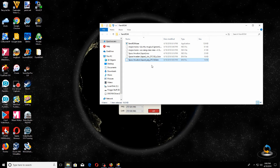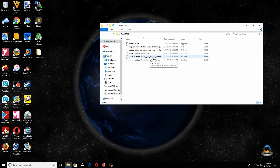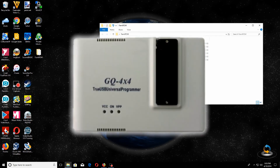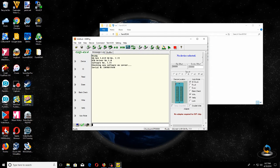Now that we have prepared the Space Invaders ROM and split it into two files — a CHR and a PRG — I'm going to, for the sake of this tutorial, burn each one into its corresponding EEPROM. Remember, the EEPROM to be used for both is 27C128 for the PRG, and another 27C128 for the CHR. The burner of choice I'm going to be using is the GQ4X4. I already placed the chip into the socket of the reader and writer.